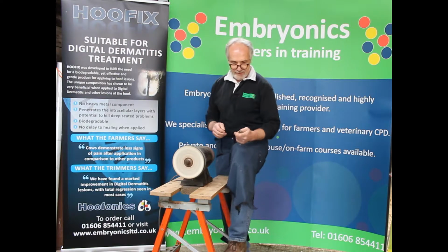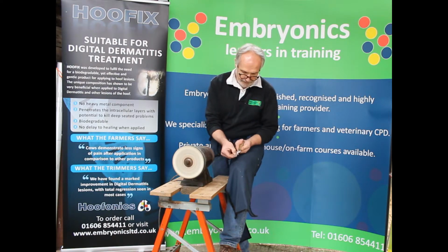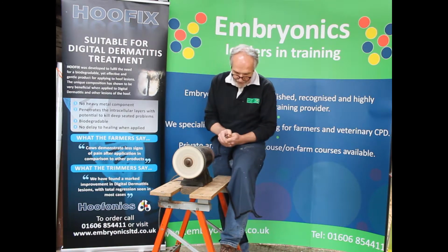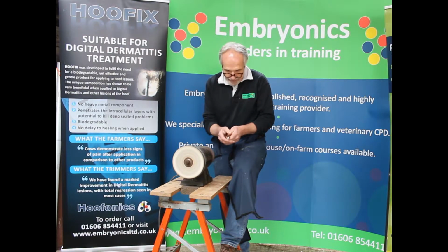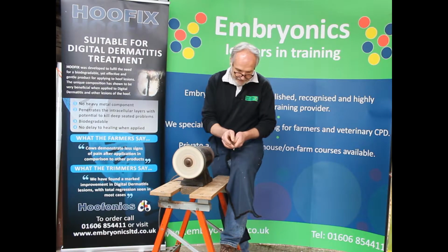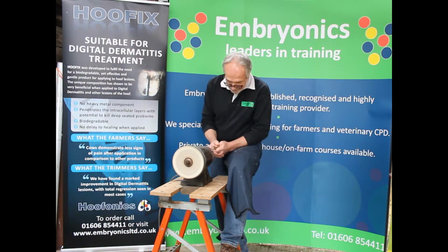When you're sharpening the knife, what you do is you start at the shoulder of the knife, and then as you're going across the wheel, each passage you slightly bend in and lean it in towards the wheel until eventually the last passage over the wheel is at the cutting edge of the knife. So I'll do the first one.